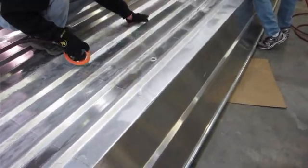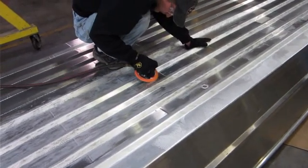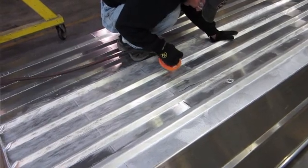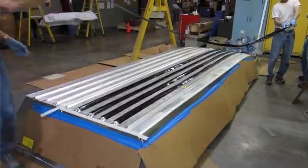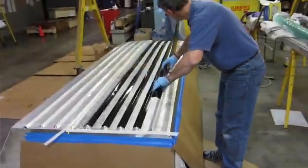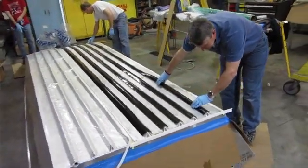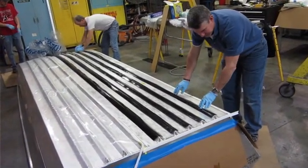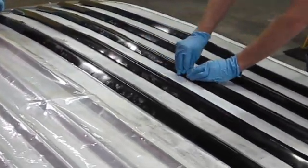We'll take the UHMW material, we will abrade it, and treat it where it can be bonded using an epoxy system. The first step is to abrade the bottom of the boat to give the epoxy more surface contact and more surface area to adhere to. We will then apply an epoxy system to both the substrate and the UHMW and put the material in place. We've carefully selected an epoxy system that works very well with our product in this environment — it's called a Huntsman 8595.